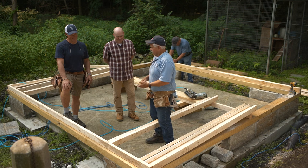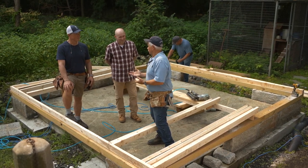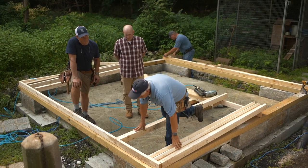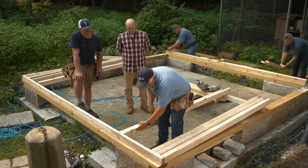Now, this is pretty typical framing. You do the same kind of framing whether you're doing a house or garage, or a chicken coop. It's 16 on center. We could use two-by-six, but don't need it because they don't have to worry about insulation values or anything like that. Two-by-fours in this case, and 16 on center, not 24. And it's all marked for that.